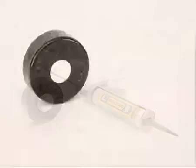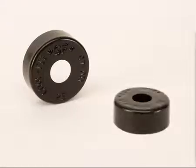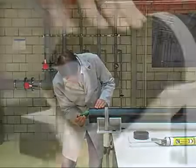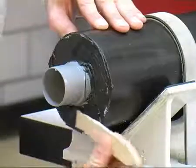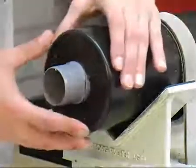The open face of the polyurethane insulation at the end connections of CoolFit must be sealed — end caps are used to do this. Cover the face completely with silicone glue, which is available in a tube or a cartridge. Apply the end cap and press on tightly.